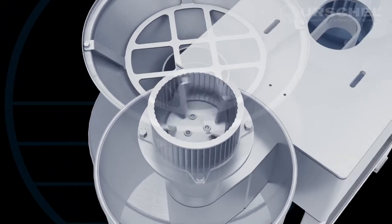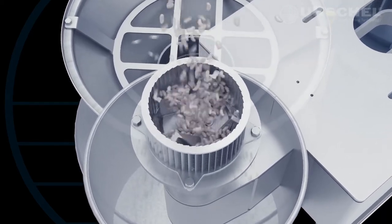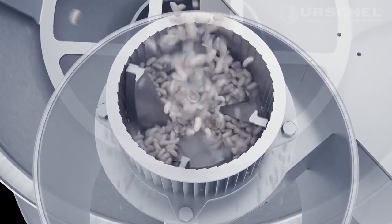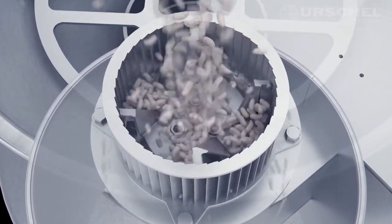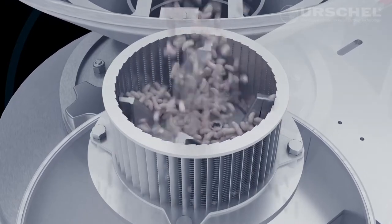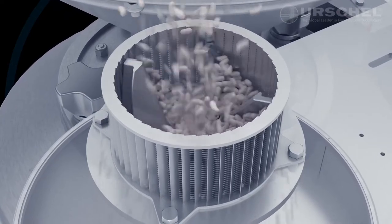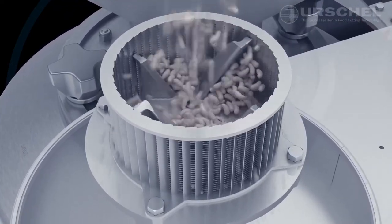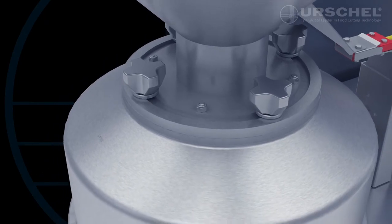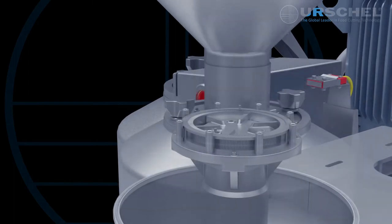Product is guided to the high-speed rotating impeller. When the product reaches the impeller, it revolves at a high speed inside the cutting head, which creates centrifugal force and propels the product outward to the impeller tips and past the edges of the vertical knives. Small portions of product projecting into the openings between the separators are cut off by the spaced columns of vertical knives. Particle size reduction is accomplished in a single pass by cutting the product rather than crushing, grinding, or smashing, eliminating rubbing friction that would produce heat. A wide variety of cutting head types and sizes are available, ranging from coarse cuts to intermediate sized particles to fine purees and emulsions.